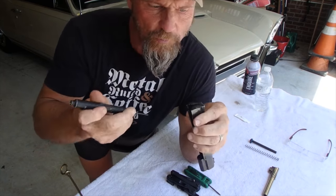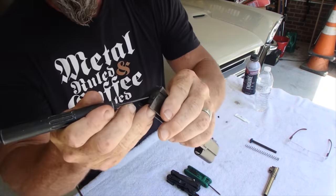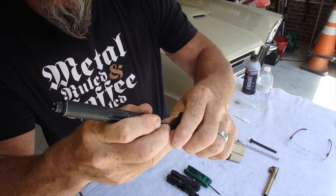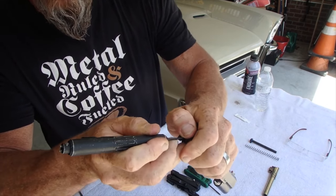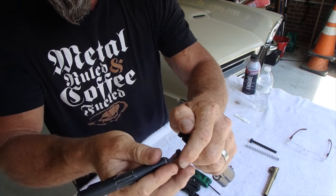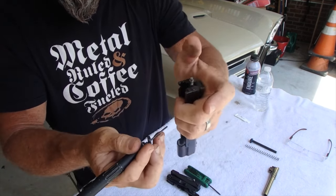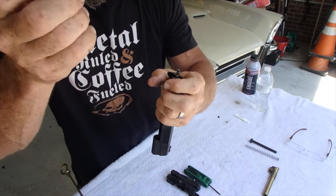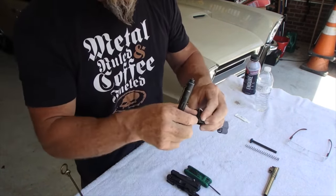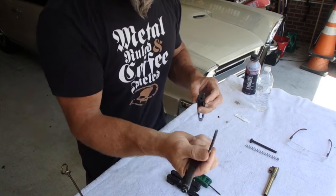So make sure you keep your finger over it. I'm going to depress my firing pin and pull down on my firing pin retainer, keeping my thumb over it. And you hear that click — that's this firing pin wanting to jump right out. Then you've got your firing pin retainer right there — boom, set that down.